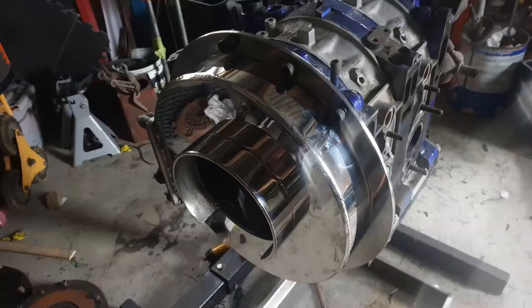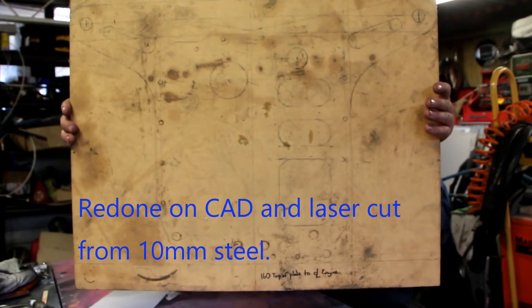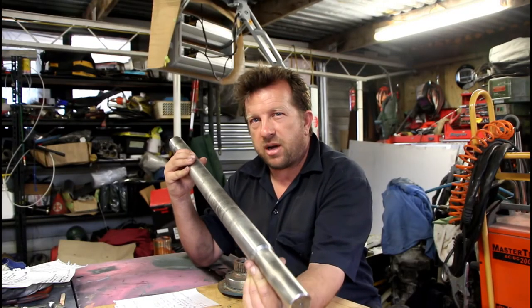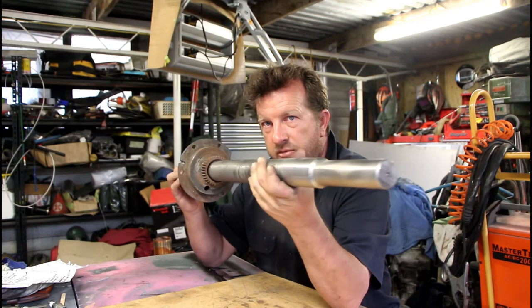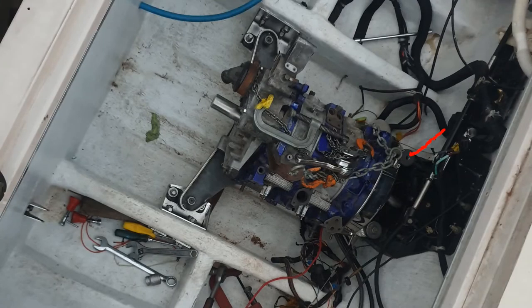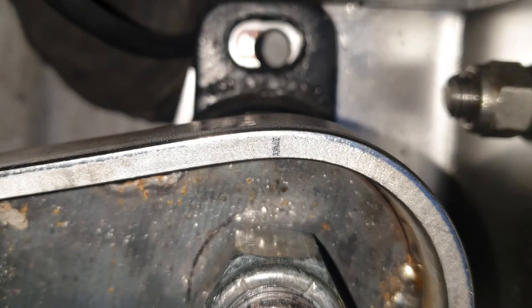Luckily I've saved a set of irons from an automatic engine for a project just like this. The engine will need to be marinized, which will involve a lot of custom-made parts, but first the engine needs to be mounted and coupled to the stern leg. Using 6mm stainless steel sheet, we fabricated the flywheel cover. My brother machined a bar as an engine alignment tool — the bar goes through two main bearings and through the gimbal bearing for engine alignment. With the shaft in place we could then make the brackets to hold the engine mounts and weld the rear mounts in place on the flywheel cover. The shaft needs to slide smoothly through the main bearings and gimbal bearings; with a bit of fine adjustment, we got it aligned.